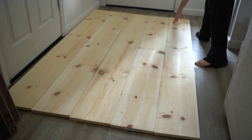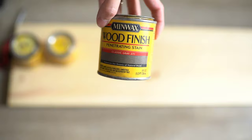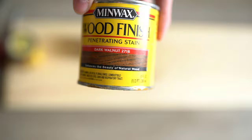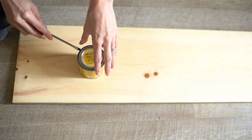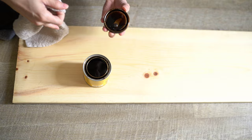The next part was my favorite — picking out the stain color for the headboard. These are all Minwax wood finish stains: classic gray, dark walnut, and Jacobean — if you know how to say it, leave me a comment below. On one of the leftover pieces of wood, I wanted to try these three different stains and see how they all looked. First up was the dark walnut. I like to apply my stain using an old towel or rag — you can also brush it on, but I really like to work the stain in, so I prefer this method.